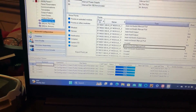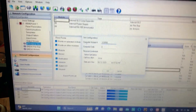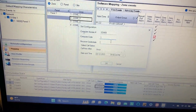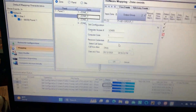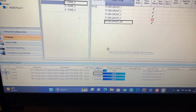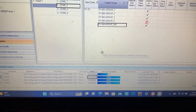That's already programmed in. Now we're just going to go ahead and save the file. Now we are ready to set the configuration. Our computer access number is 1-2-3-4-5-5, and the computer code is number one. I'm going to put zero for our receiver credentials and when we press OK it's going to go ahead and process and download the program file to the panel.